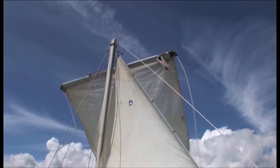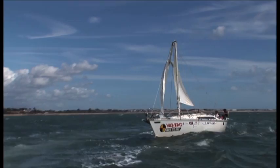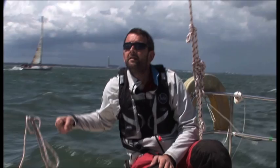The basics of it are get a mast and hang some sail off it. If we didn't have a stump, then we could have maybe done this with the main boom using the spinnaker pole, and use the main boom as a yard. There are ways of doing it, or A-frames maybe, but it just depends. You get some sail up one way or another. So you need the elevation, you need some sort of spar. We've just managed to do it with the stump.